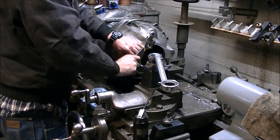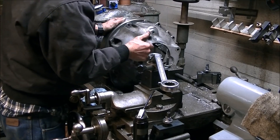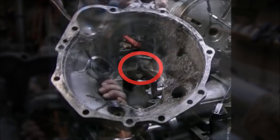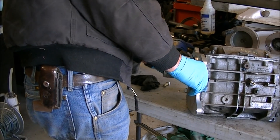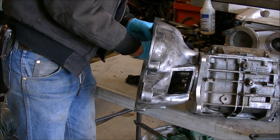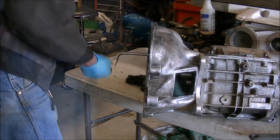A couple passes with the boring bar and I got it to the right size hopefully again. Let's take a look inside there and see what the part was that caused so much trouble — there's that little boss that caused so much grief. With the bell housing bored out and a good fit, it's time to try and bolt it all together. There are four bolts that come through the transmission into the adapter plate, and four bolts that go through the bell housing into the adapter plate, and with that we can hopefully get this thing bolted onto the engine.